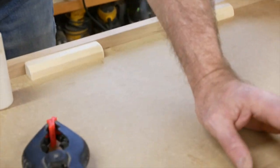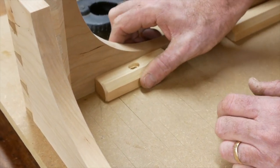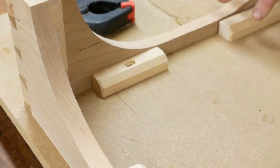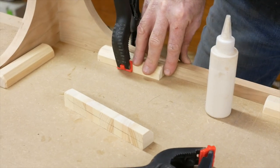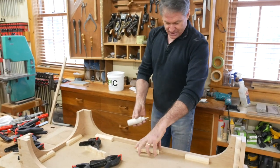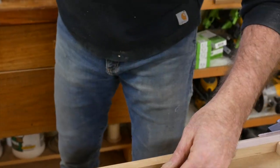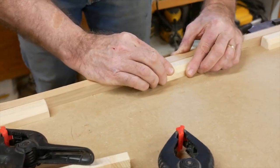And then the only other specialized thing is these slotted glue blocks, which I'm going to put in the back to allow the case to expand and contract seasonally, where the front glue blocks will be glued to the case and holding it securely in the front with the cove molding will attach later on top. Let's get this one in the center first. You don't need a ton of glue on these. I like to just eyeball it and rub fit